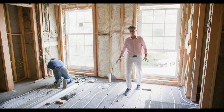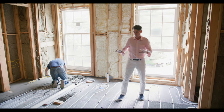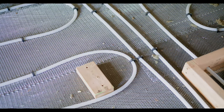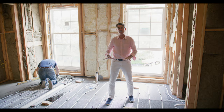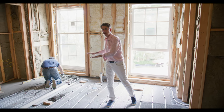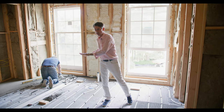We're in the principal bathroom and we want a really nice warm floor. What you see going on is a hydronic radiant floor heat system — tubing that's been stapled down. To help even out the temperature, we're going to set the tile on what's called a mud bed. That's what this man's doing now — putting in about two inches of cement that they'll lay the tile on top of.